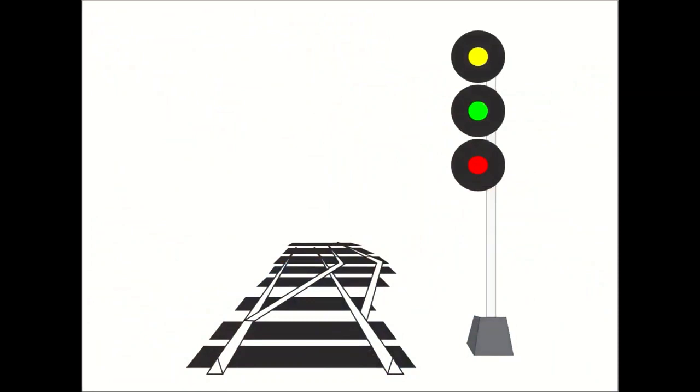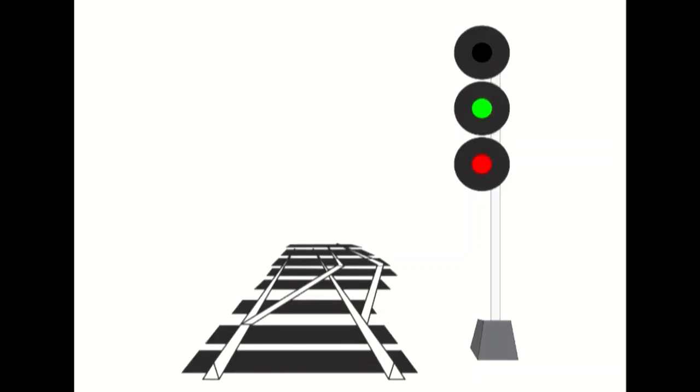If we carry on at track speed, and the signal is warning us of a slower speed up ahead, then the top head will be yellow, indicating we can pass this signal at track speed. But there's a restriction up ahead. The next head down will be an indication of the speed restriction we're going to encounter. For instance, medium speed. If the medium speed is 2 signals ahead, then we flash the top head. Just like before, that is an advanced warning. In this case, advanced clear to medium. We pass by this signal at track speed, expecting a medium signal 2 signals ahead.